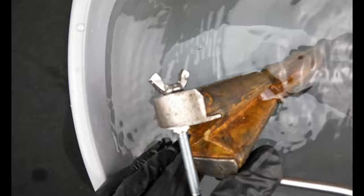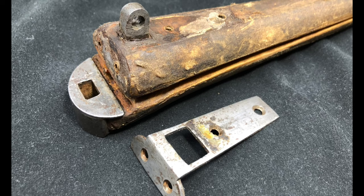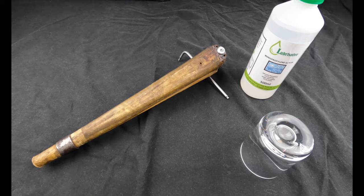Next I wanted to try and repair the bellows. A quick test confirmed there are quite a few leaks, mainly on the main corner crease and also some under the metal plates. This called for some very intricate gluing. Once I'd done the corner hole, I also tried to glue up underneath the plate. I used E6000 adhesive, which is really good and strong, glues leather well, and is flexible, but it takes 48 hours to cure. So I'd glue it, test it, find another hole, glue it again — the whole process took about a week. But eventually I got it sealed.